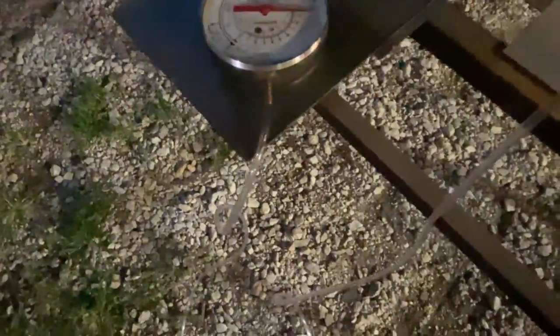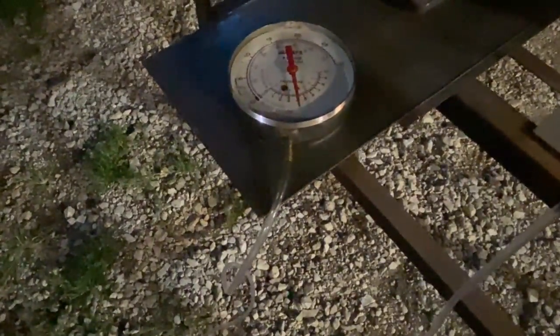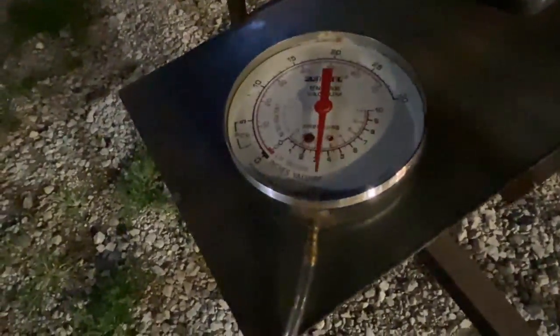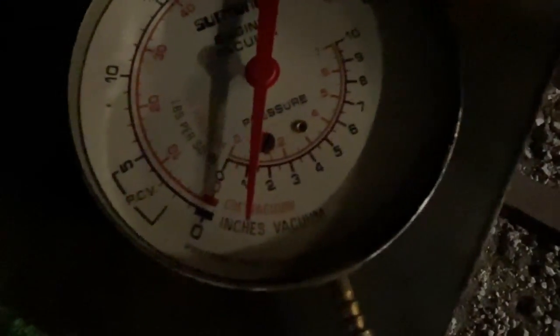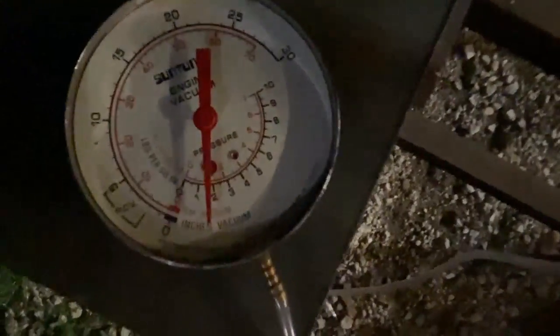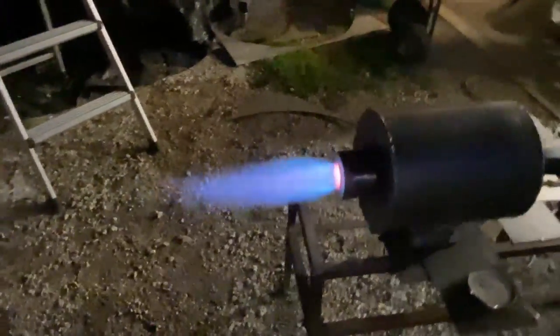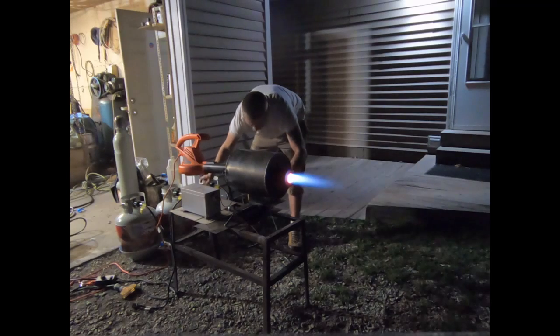So this jet engine is essentially acting as a pre-burner that gives us stable external combustion, which is going to be directly impinged on a large molten bath of brass. You can see I'm running at 7 psi here — some industrial gas line supplies do go as high as 7 psi. I'm waiting on a customer to get back to me about the pressures they have available. I can't tell you who this customer is — they're just a bit too big for me to be associated with my driveway experiments — but it's a very large company and I'm blessed to have this opportunity.